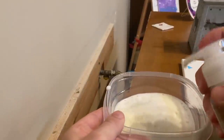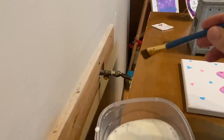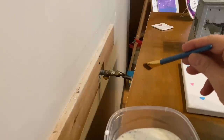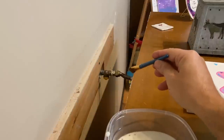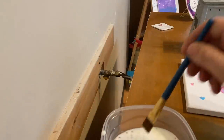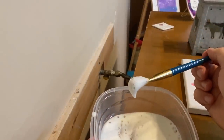I've got one of these foaming dish soap dispensers. I'm going to go turn the gas on out in the shop that feeds this. We'll turn the gas on and test our first connection there, then we'll turn the valve on here and test all the other connections including the flexible line, the fitting on the gas valve, and down at the other end of the valve where it all connects. I'm just going to use a paint brush and suds up each connection and look for any bubbles.